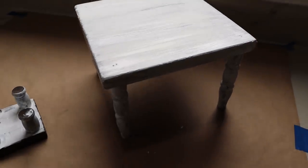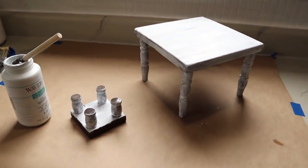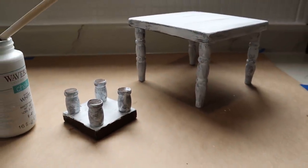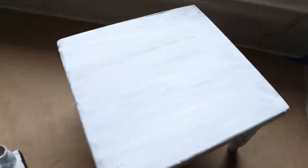Here's a close-up look after one coat, and you can already see where the paint is just not taking to the wood — which is what we want. I have one coat on here, but I want two coats, so I'm going to let this dry, flip them over, do two more coats on the unpainted sides, and then come back after that's dried and work on removing the paint from the Vaseline areas.